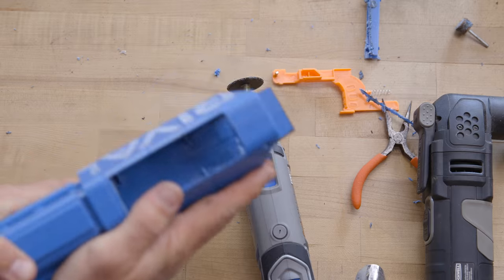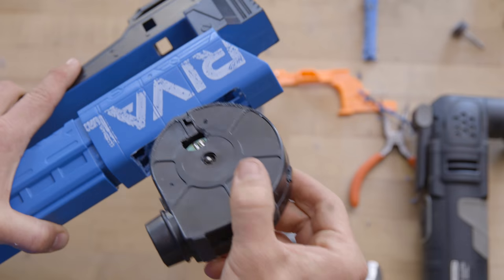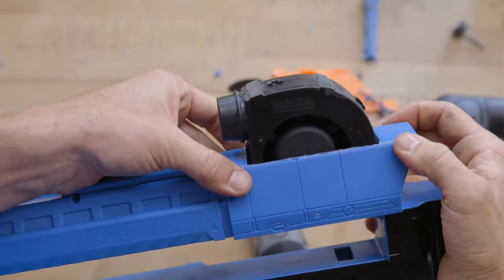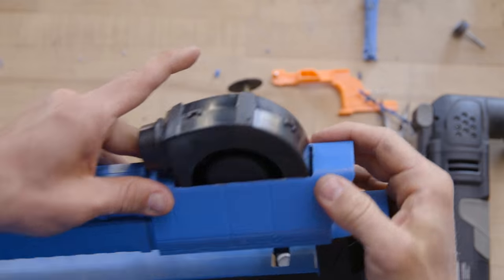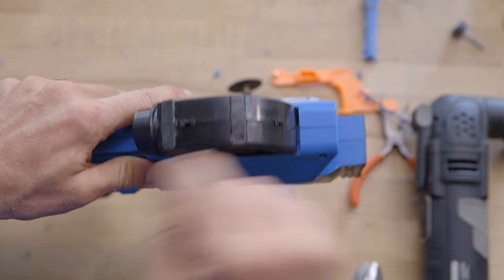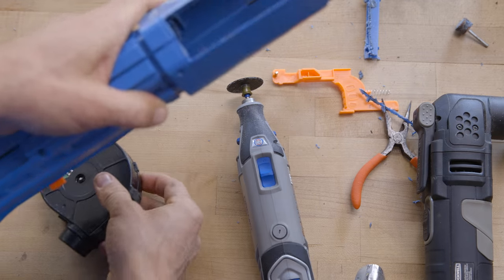So now we've got the top hole cut, and I like to make sure that as I trim this down and clean this up that it's actually slightly small. That way when you pinch the shell back together with these two screws, it will actually make this very secure, which holds the rest of the tube in place really well. So what I tend to do is those base measurements, I go a little bit under and then sand out. Now I will say that did take me about 30 minutes just to cut that little piece out, and I haven't even finished cleaning it up.